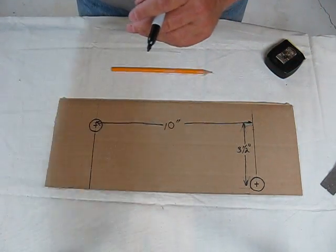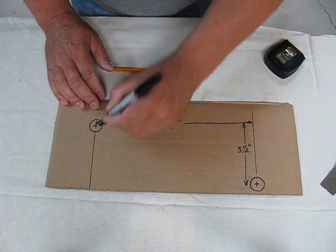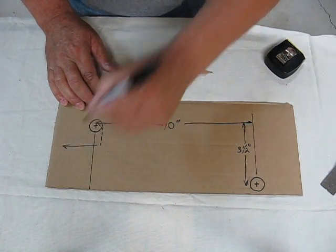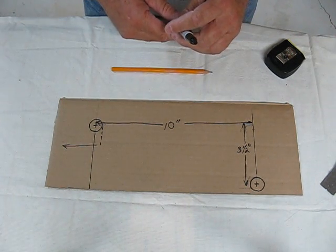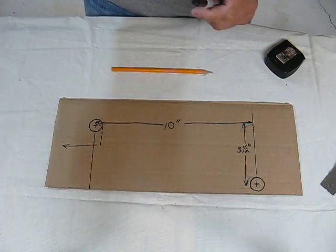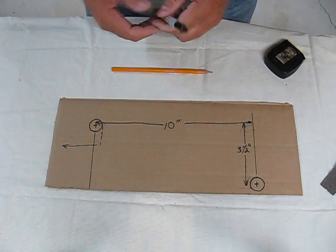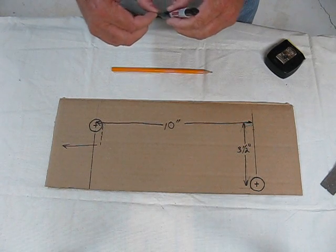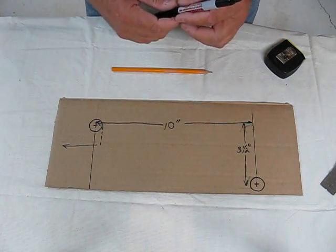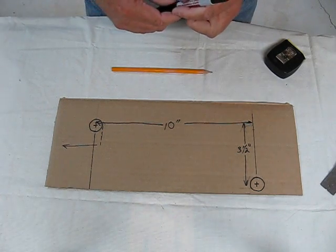If I want the trunk to open up all the way without hitting the wall, I measured from a flat surface to the first part of the mount. From this edge to the wall has to be five inches. I'm going to give it a little more — about five and a half, maybe even six inches — so I'll have clearance for the lid to open up without hitting the wall.